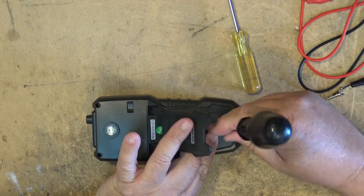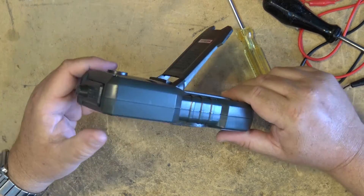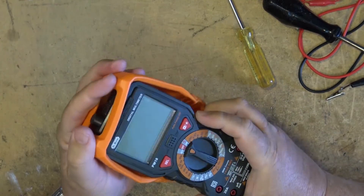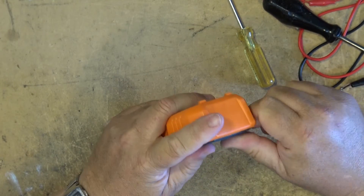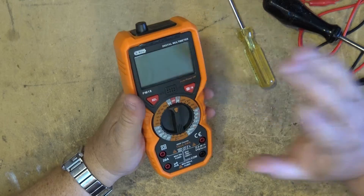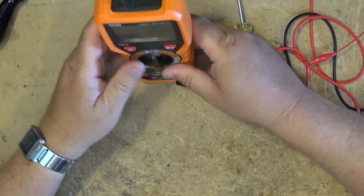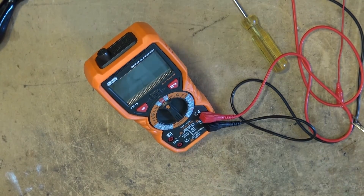I was able to test diodes and transistors. When I tested a blue LED — which is something my Fluke meter won't test because it only tests at about 1.5 volts — this one tests at 3 volts for diode testing, so it can test blue, violet, and white LEDs and measure the voltage drop. Testing white LEDs in an LCD TV, you can test all the diodes individually with this meter. That's the teardown — pretty impressive for what it costs. I give this one a couple of thumbs up, thanks for watching.